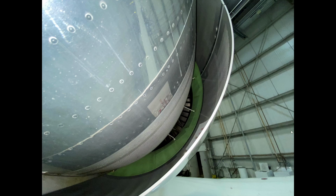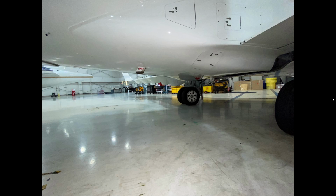And once we've achieved below 200 knots, we're going to press our emergency reverser stow button, which, well, we'll talk about this in the future, but they affectionately refer to it as the $1 million button. If you press that button, you're going to cause a whole bunch of damage to occur, but the reverser will shut. So we want to make sure we don't press that button.